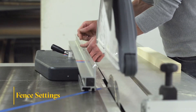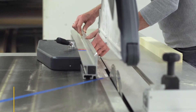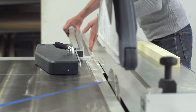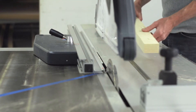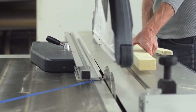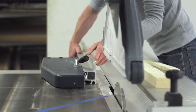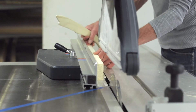Other protective parts are the top guard, which shields or covers the top of the saw blade, and the riving knife, which covers the back of the saw blade and reduces the chance of kickback. The rip fence is adjustable — you can move it horizontally back and forth, but also put it flat or upright. You put it flat when you need to cut small pieces of wood so you can still use the push stick, and you put it up when you need support in height.